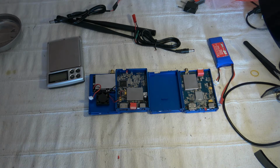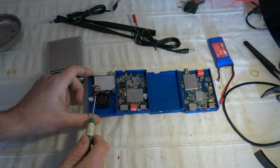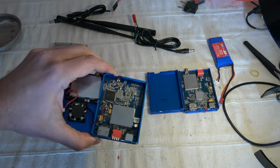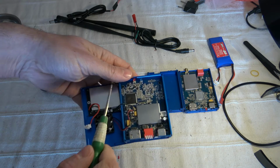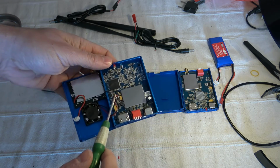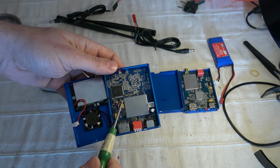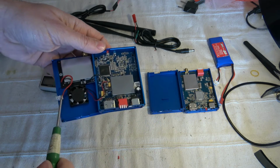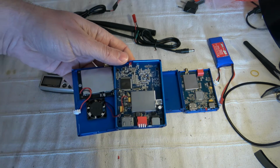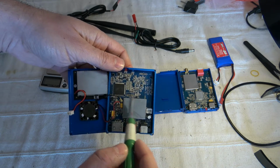Okay, here is the internal part. So for the transmitter, I detach this connector. This is the main power. You can find all the electronics, and you have two modules protected by the metallic casing here, linked with this antenna. This one has a micro FL connector, and this is a power cable to be connected here. But as you can see, you have some remaining UART port here, and USB potentially remaining.